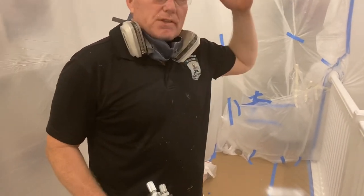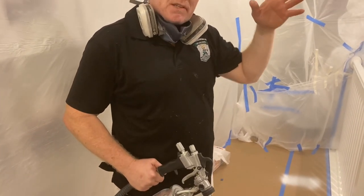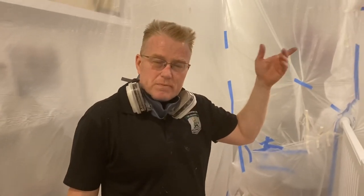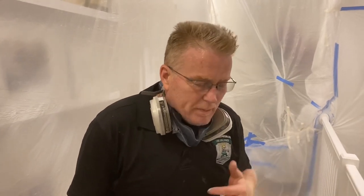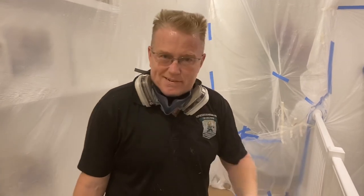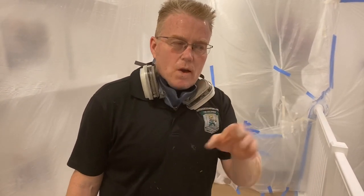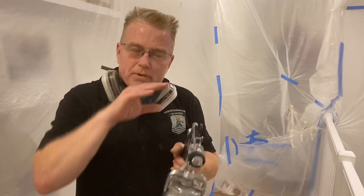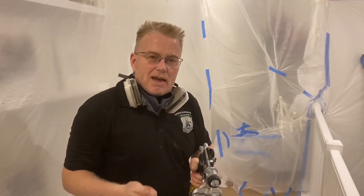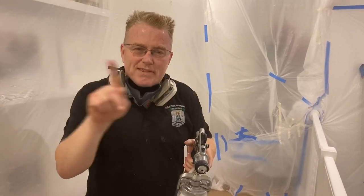Why not? Because the jets would not allow the water to come out with the same pressure if it changed the distance from which the water flowed from the jets. It would be at a greater distance and therefore clean less. As soon as I change the angle, I change the distance between the paint coming out and the target. And so, to keep it universally shiny, without flashing, without lap marks, and without spray marks, we apply the paint at the same pressure, at the same distance, and at the same angle, so everything looks the same.